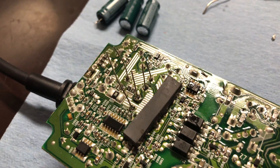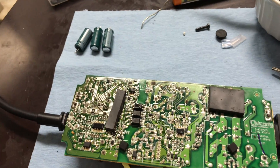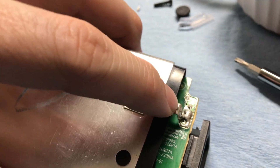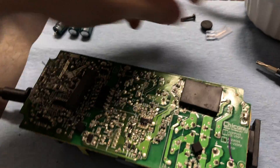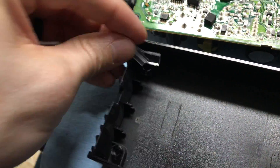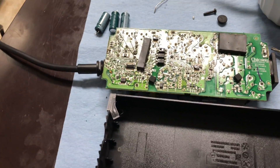After you've done all of them, come back and just clip the tips off — you just need a tiny bit in each spot to hold it and make electrical contact. Then put the cover back on the same way it came off, and solder those ends back in. You probably don't even need to add any solder — just heat the solder that's there back up, stick this back through the slot and let it freeze back up. Don't forget this little guy here is the light indicator — when you put it back together it should sit just right in the corner of your box. Line up the cable ends with the grooves in your housing, put your screws back in and you should be golden.